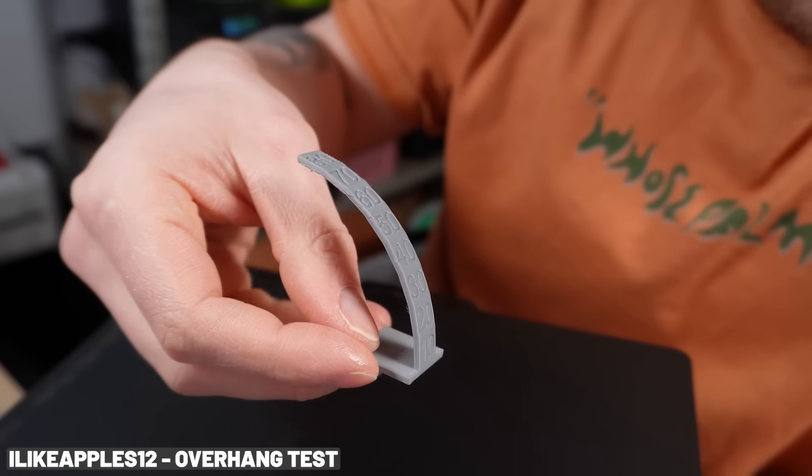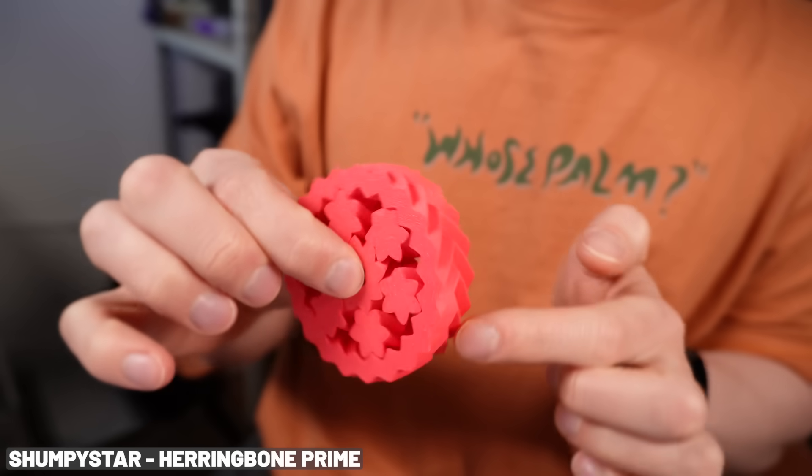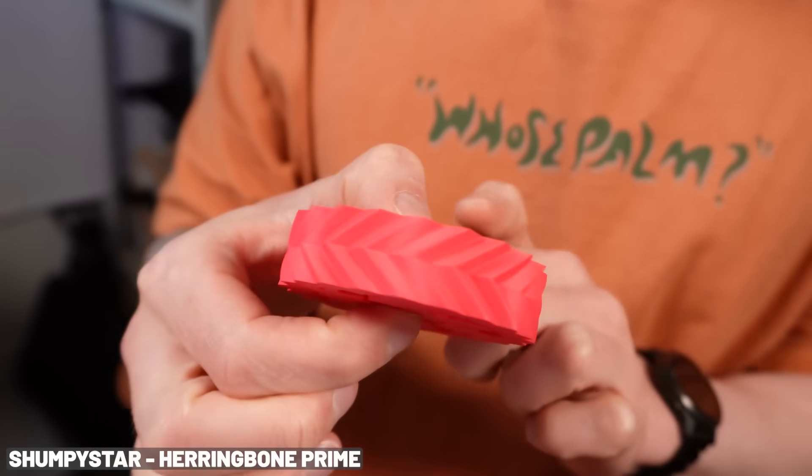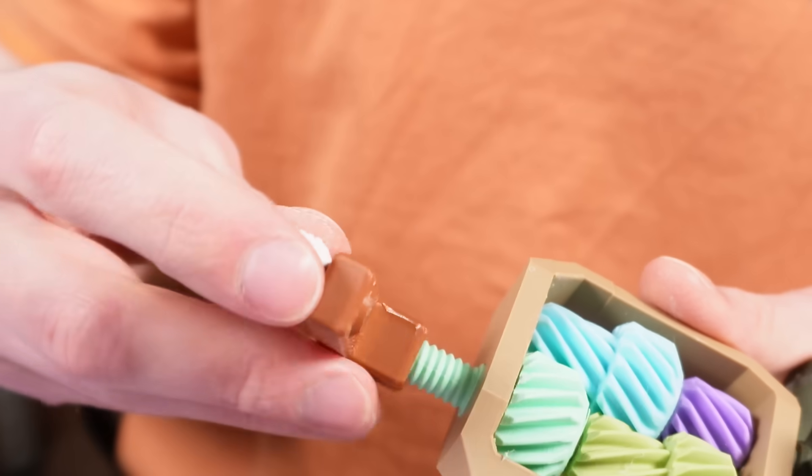As it turns out, we're not always just assembling by slotting parts into each other parallel and perpendicular like a shape sorter. Sometimes we have an overhang or a complex surface that two parts interact against. Modern 3D printers can cope with really shallow overhangs without support these days, but I still try to keep every overhang angle to 45 degrees or less because that does seem to be the threshold at which accuracy begins to go down a lot. Using simple overhangs, I made some of the structure of the housing and this thread on the output side of the gearbox. If you design the teeth of your thread to have no more than 45 degrees overhang and leave a sensible gap between the faces, you can get a functional and reliable screw thread with 3D printing.